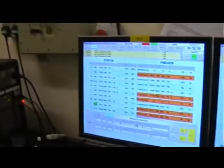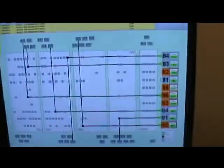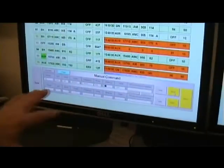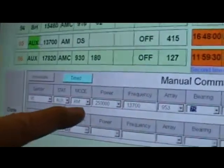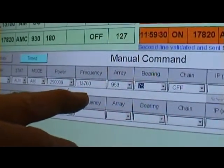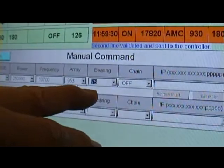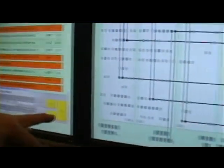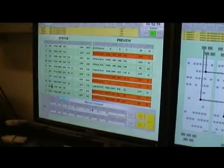We're now in one of the RIS transmitter fire cells — not to work on the RIS transmitter but just a quick look at the control system, because we need to put an antenna array on Sender 95 so we can power it up. This is the manual part of the screen and we've programmed Sender 95 to be there. It's on AUX at the moment with no high voltage. It's going to be in AM — amplitude modulation at 250,000 watts on 13.700 MHz, which you've seen before on the synthesizer. The antenna we're going to use is array 953 on a bearing of 75 degrees.